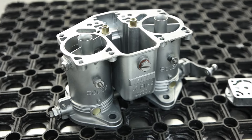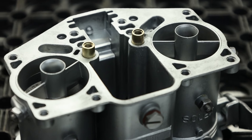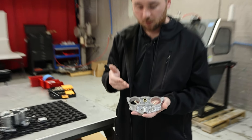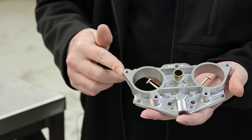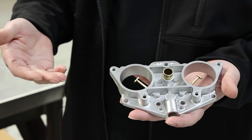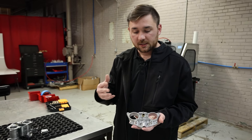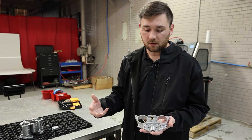We're back with the carb that came off of the Porsche. Just wanted to show you guys the end results. This was just a glass bead, but you can see how polished this is. When you have threaded areas on pieces with vapor honing versus other processes, you're going to get a better finish, but also you're not going to tear up the metal or remove metal.